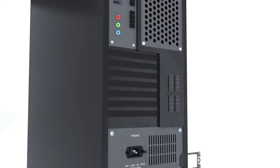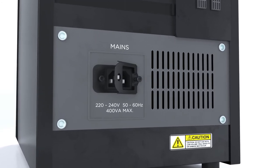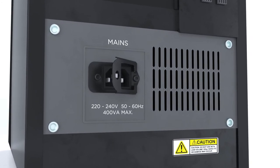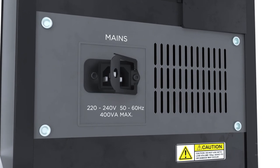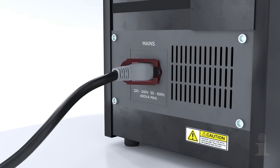Using the outlet or inlet's two mounting screws, simply attach the Interpower connector lock to the inlet face. Be sure to tighten the mounting screws securely, connecting the connector lock and inlet hole to finish assembly. This will transmit any pull force to the cabinet, eliminating any strain on the connection.